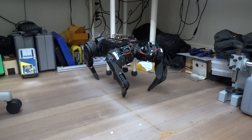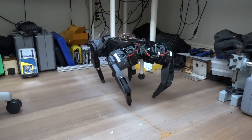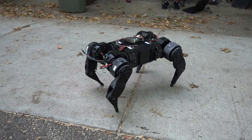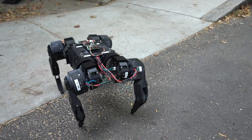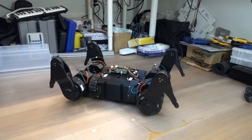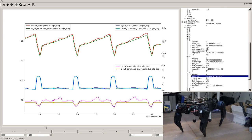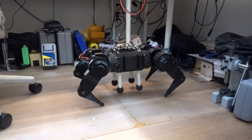Currently, the robot has four inline coaxial legs driven by servos with gearboxes. While more strengthening is likely needed, this version is capable of walking and at least some dynamic maneuvers. Now that the servos, legs, and chassis are mostly functional, I'm beginning to conduct more interesting dynamics experiments, like standing up and sitting down from flush with the ground, commanding and monitoring all 12 servos at a high rate, and experimenting with some low-power dynamic maneuvers.